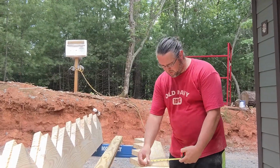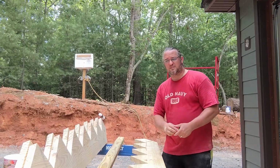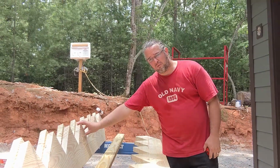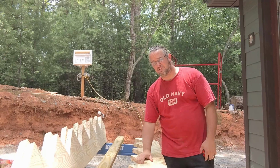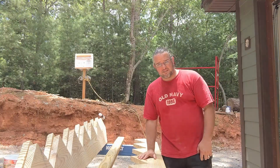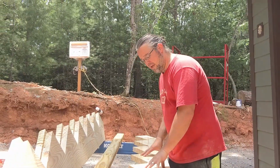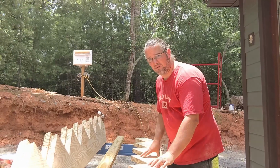I have about 5 1/4 inches between my cut and the edge of my board. My staircase is right on the edge. I could use 4 and it would be overkill. Three stringers should be just fine, but I want this to be rock solid into the future. It's no surprise that lumber prices are skyrocketing right now. And if I go with four stringers, that's going to cost me another $35.